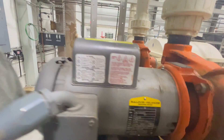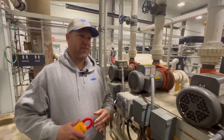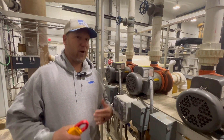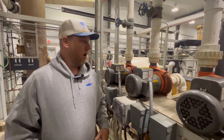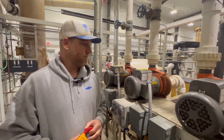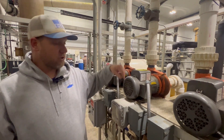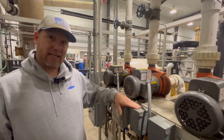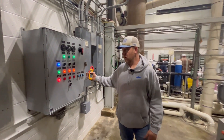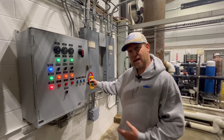Now I'll show you how to actually take your amp measurements at any time. If your amps exceed your maximum, that allows you to know that you have a problem that you need to investigate further. Our pumps are at 230 volts so they should not draw greater than 8 amps. You can do your readings at the enclosure on the pump motor, at the disconnect, or at the pump panel. You should be a licensed electrician to perform this inside the pump control panel.